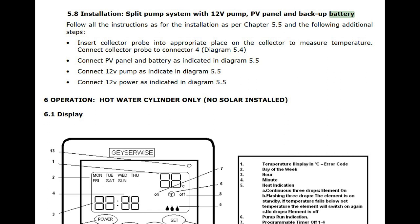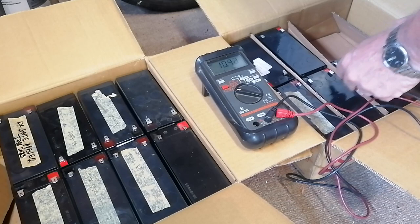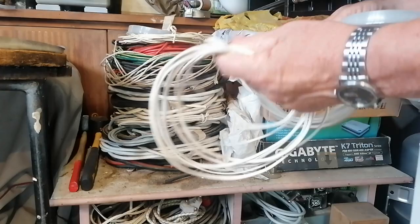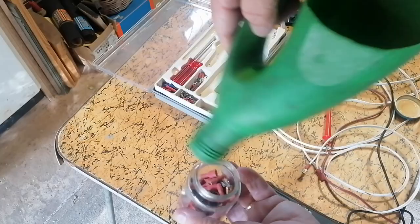The manual suggests a 4 amp-hour 12-volt battery, but I had a selection of old 7 amp-hour UPS batteries which I assumed would work fine. I selected one that still looks usable, grabbed some twin flex wire, and crimped spade connectors on the battery end. Although the wire has a colored cotton indicator inside marking which is positive, I made sure by putting a knot in the positive wire as well.